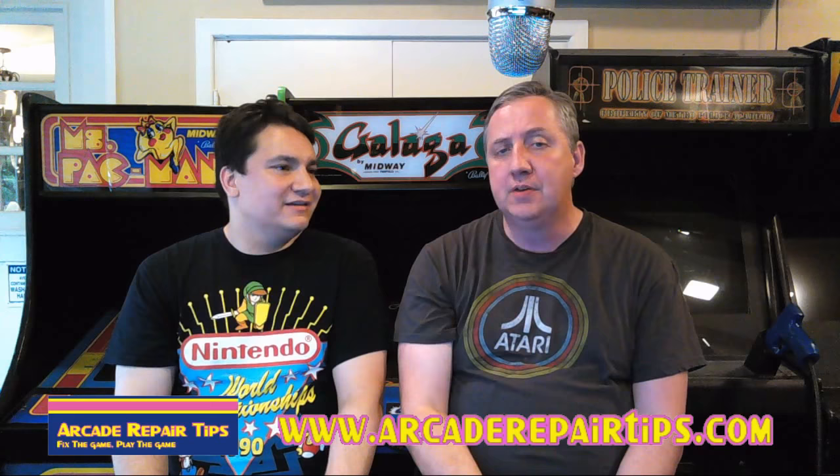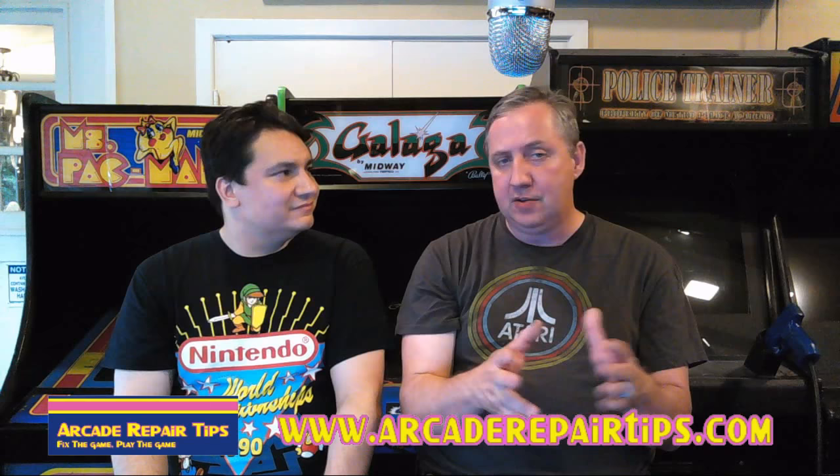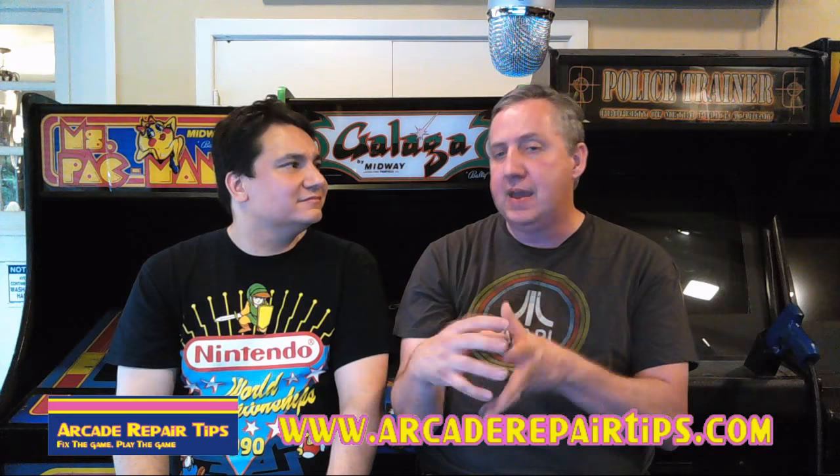In order to change that to a 5mm or some kind of coin that's about the size of a nickel, or a nickel mech, you can't just take that mech and screw it down. You've got to change to a different mech. Correct. So a good example would be a quarter mech versus a nickel mech. Correct. You've got to have a nickel mech. Then you can adjust it to where it'll easily take a nickel, maybe a little bit more. And there are a couple other adjustment places.